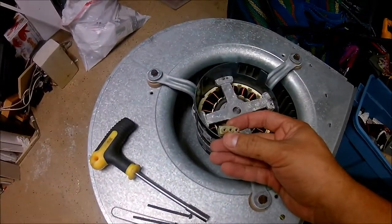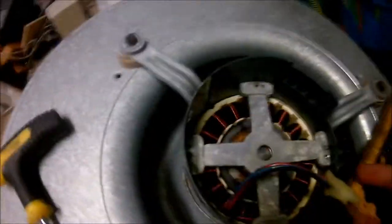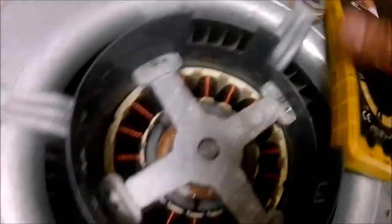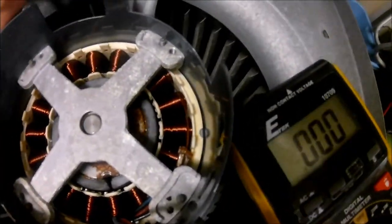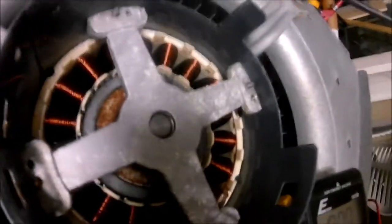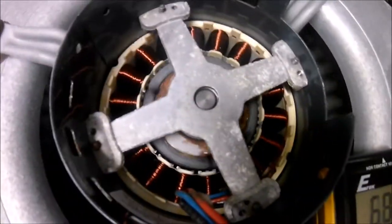I'm going to go get the new one and we're going to test it with a meter here. You can test it with a meter — when you spin it, there should be voltage coming out. That's just to show you that the brushless motor has voltage. Motors by themselves can generate voltage since they are magnetically induced. So if you spin it, as soon as you spin it you'll see voltage — see that? That's just between the red and blue. Now we're going to do black and blue. Same thing. See the voltage? That's because it's generating movement.